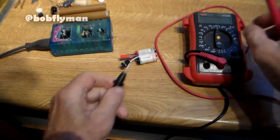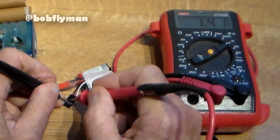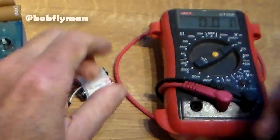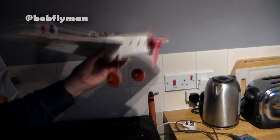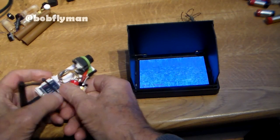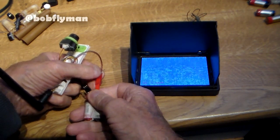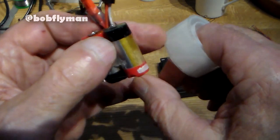The lights have gone out so it's charged now. Let's check it with the digital meter — easier on the balancing lead. We've got 8.25 volts across the two cells, and looking at them individually: 4.13 there and 4.12 there — so fully charged. Let's see what it does when I stick it in a model. Just right for this flight-test mini scout foam board plane I built. It'll be equally good — small and lightweight — for some new FPV stuff I'm going to start messing about with. Let's just plug it in... yeah, look at that!